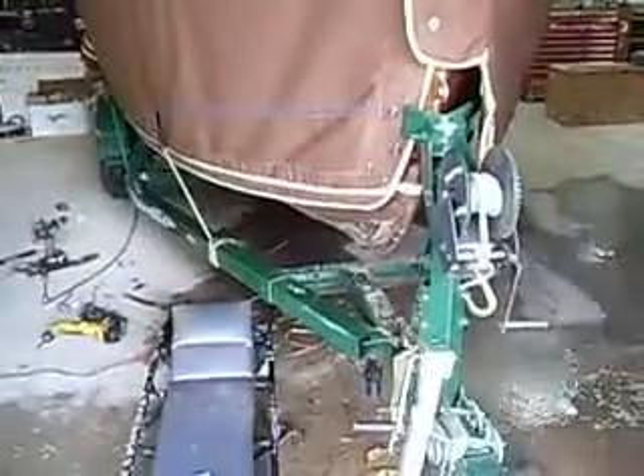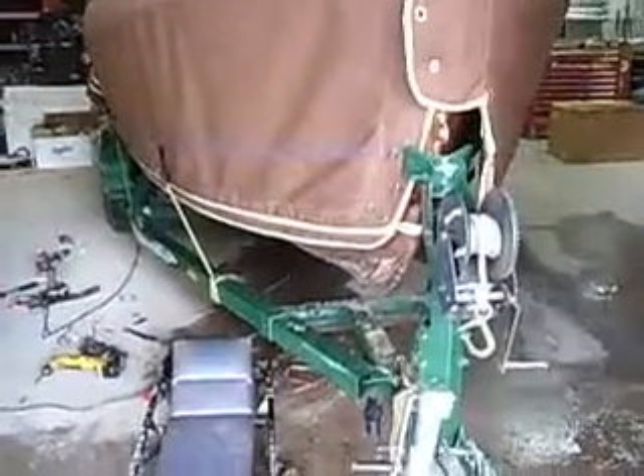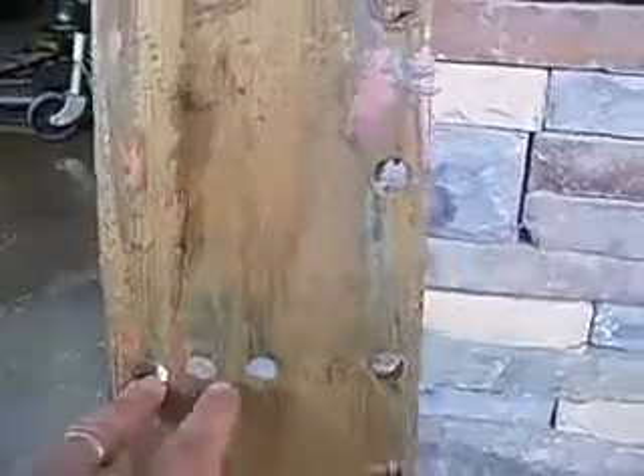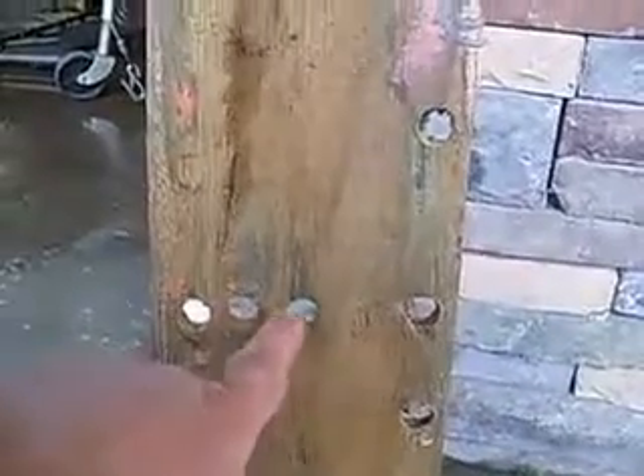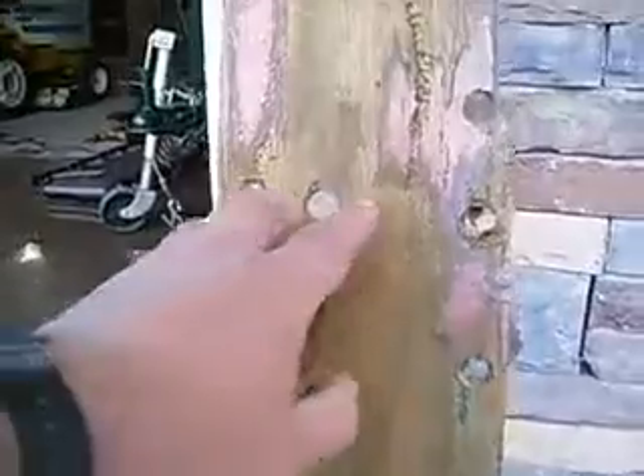The other method would be we would add additional fasteners to the bottom. For example, you can see when we get to a frame, we've got three fasteners — and the fastener holes are much smaller here than what I've drilled around. What we would do is go between and add new stainless steel fasteners. Originally this was silicon bronze — we can even add silicon bronze fasteners — but if you have no plans for salt water, there's no reason to go to silicon bronze at the extra expense.